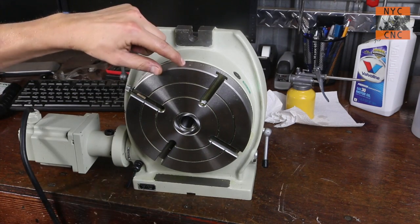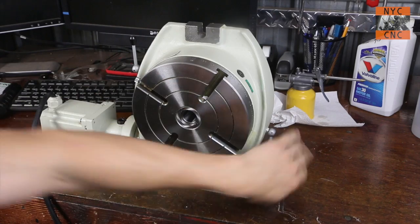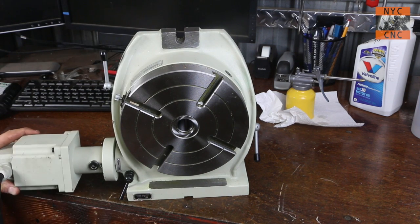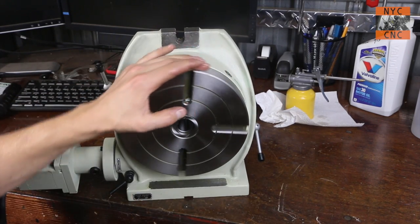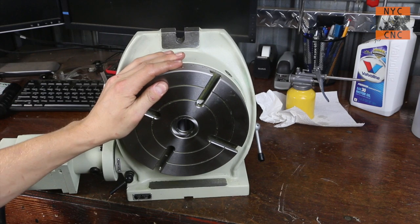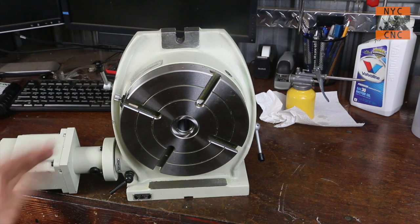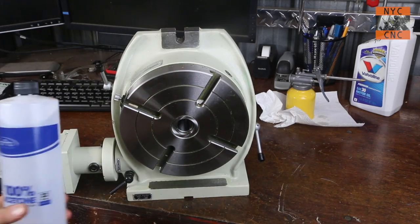Oiling it first. There is a little spring-loaded dimple here, and there's one right here. And then there's something called the oil reservoir which we have to get at right here. If your dimple is not at the top here, rotate this 90 degrees — that's intentional. Make sure these three screws are loose, and your fourth will rotate actually quite nicely. So put that at the top. You're supposed to oil it in the position you intend to use it. I'm going to use it in the vertical position.